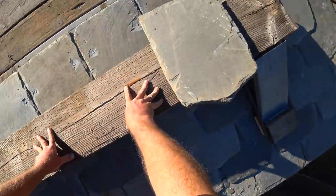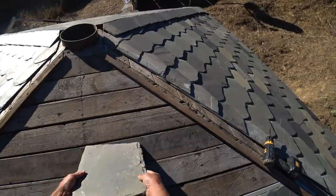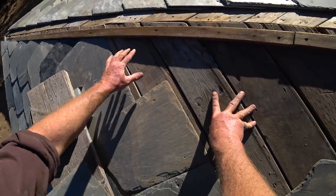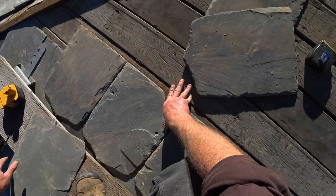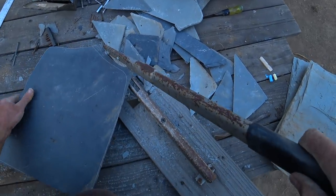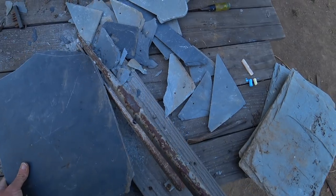Let's see how it is to get up here — looks pretty easy. Wish me luck. We leave this slate off, and this corner slate we're not doing yet. So there are two slates we don't need because of the roof jacks. Here's a good example of a really hard slate — it's like pretty thick too, maybe 3/8ths or even a little thicker in parts. You can really hear the difference — you can hear that hard crunch. Contrast that to this softer one. The harder the slate, the longer it's going to last. A lot of the slate on this roof may not last that long.